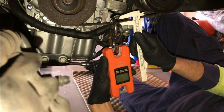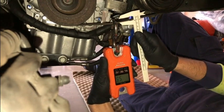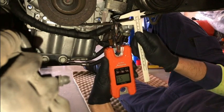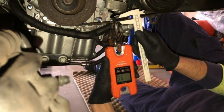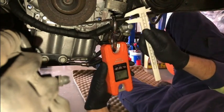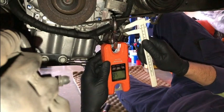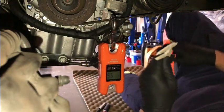So this is not correct — as you can see, I've applied only 5.6 kilograms of force and the deflection is already 10 millimetres. That means we've got to adjust the tension to make sure we actually get 10 millimetres for 10 kilograms of force.